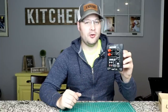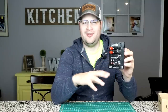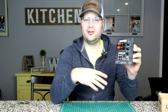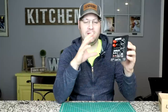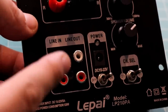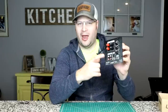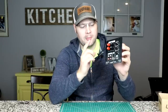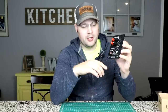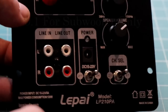There are a lot of really cool applications you can have with this. Let's talk about what it is and maybe what it isn't so you have a good idea of whether you're interested. This is a plate amplifier, meaning that the only input is the line input on the back. It's not Bluetooth, nothing else — just that. You can add a Bluetooth adapter to it, but it only has that one input. It does also have an RCA output.